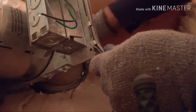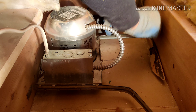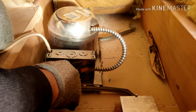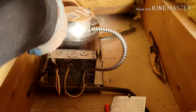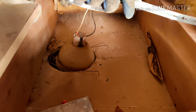Once I succeeded in getting one of the lights out, the bulb over there is held to the can using some kind of small string, so I had to take that out as well. The second light I'm just bending those elbows out — there's really no technique here, it's all brute force. Then I'm checking to see there's no electricity there and opening up the wire nuts so I can take the Romex that runs into the can light out before I nudge it open.